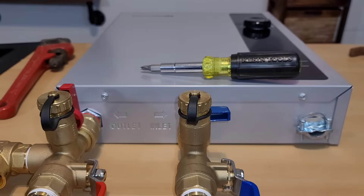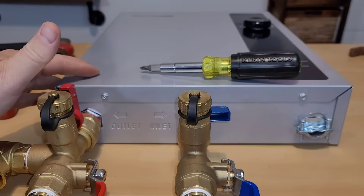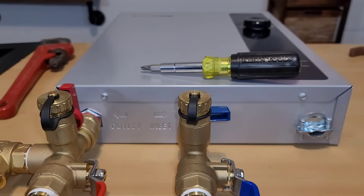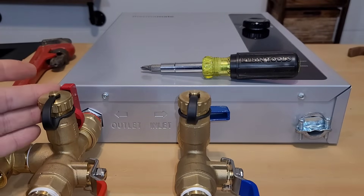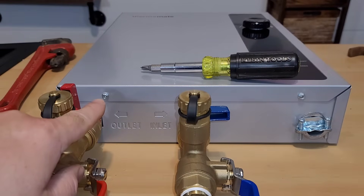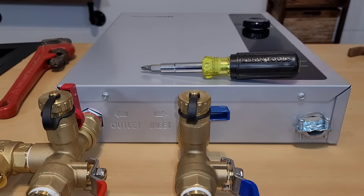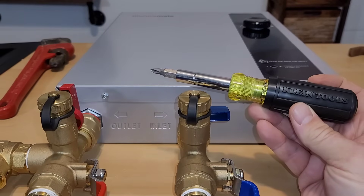It's time to officially tighten down all our connections, going from the top down. I need to take off the cover of the hot water heater — there are four exterior screws, two on the bottom and two on the top. I have the diverter in the open position just to get my screwdriver in to loosen the screw, but I need to remember to put it back to the closed position before reassembly so I don't have water coming out at me.